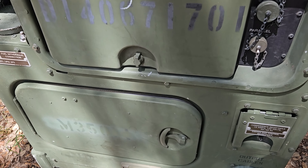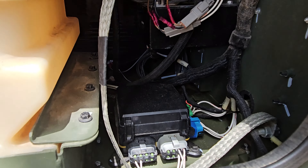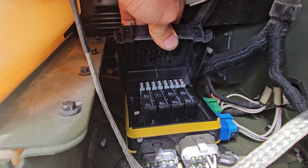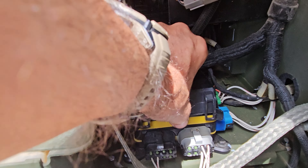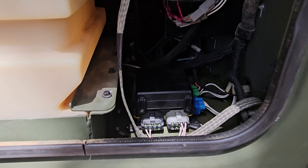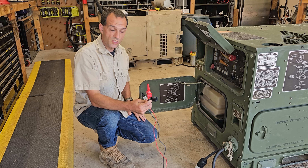Let me explain this better. P90 is back in there — you can actually see it, though the connector goes a little bit farther up. This box right here — if you squeeze it and open it, you'll see there are circuit breakers back in there, numbered up top like in your vehicle. Circuit breakers 10 and 11 have to do with the two circuits for excitation and the coil. Those are part of troubleshooting as well. I checked them and they weren't tripped or bad — I actually pulled them out and tested them to make sure they did what they were supposed to.